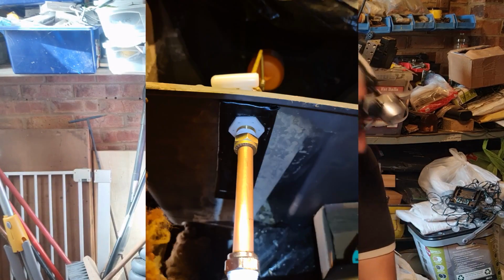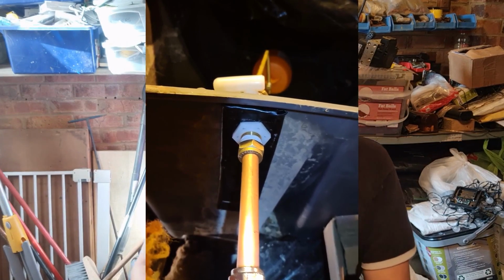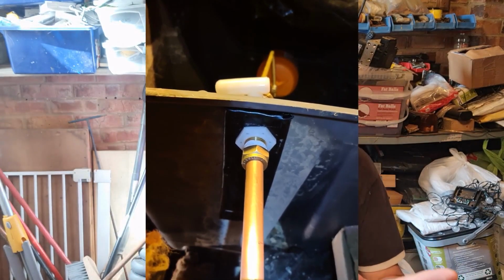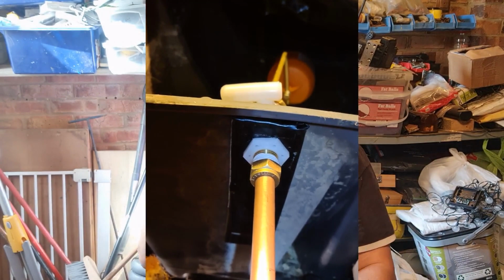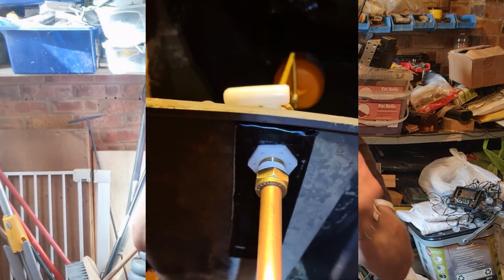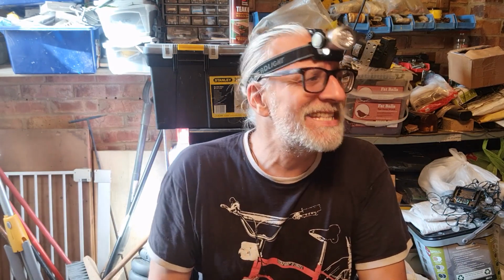Now, what you can probably see, a couple of things. You know, Mr. Plum is not one for bodges, but I could not find a replacement support bracket to go on that ballcock. So what did I do? I bodged it. I took it off, cleaned it all up as much as I could. I covered it with anti-rust stuff. I ground it all down. I then covered it with sealing tape and then waterproof tape, and then cut a little hole in there for the ballcock valve to come through, pulled it all back on, and that's what you see there. So all done, all cushy, job's good and bone dry for the first time in about 20 years.